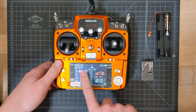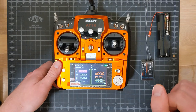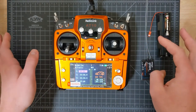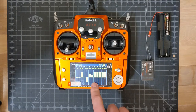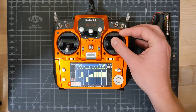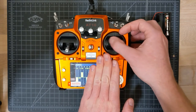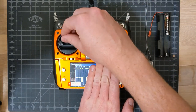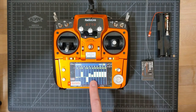I've programmed this with my username as Travis and the model called CatToy. The radio calls it a car type, which sort of changes the default control scheme — which I then completely customized for this model. Going into the servo output view, you can see all the different channels moving. Channel 2 is the elevator, channel 1 is the aileron, channel 3 is throttle — interestingly it's reversed, which I guess is a convention — and then we have the rudder. I'm actually using channels 6 and 7 to control the motors on the CatToy, where each motor controls one wheel. The vehicle steers like a tank with differential speed control.